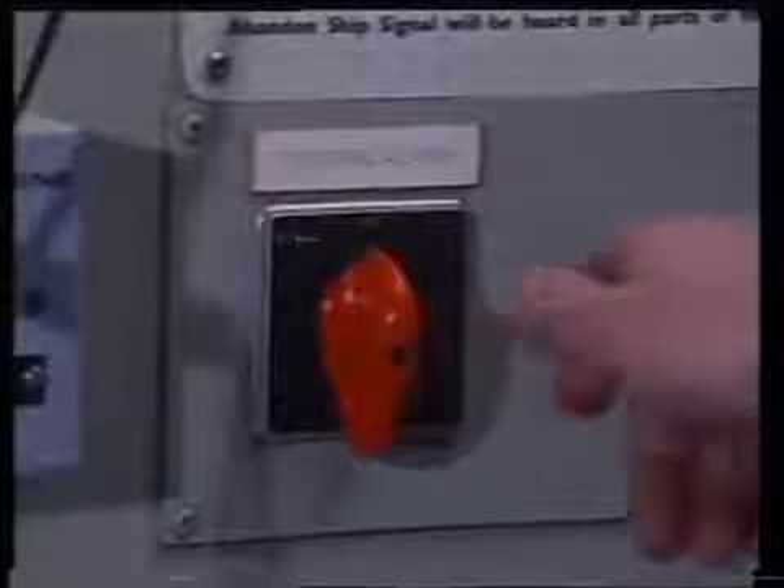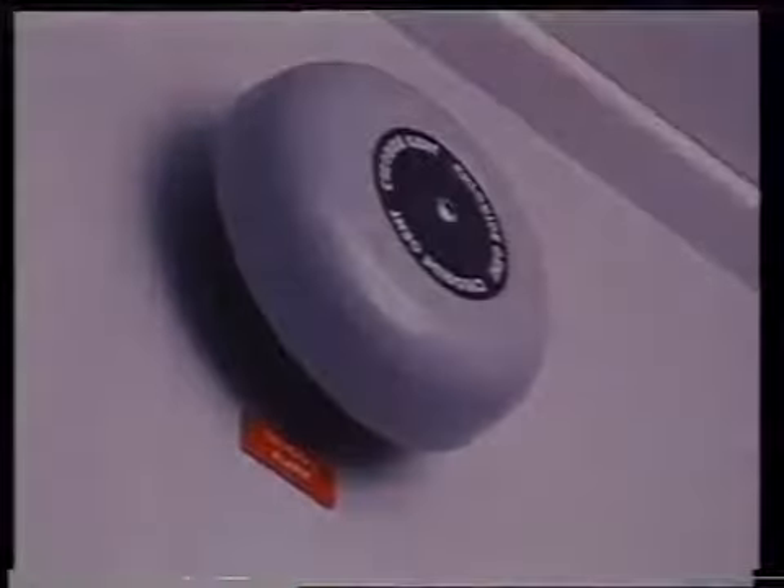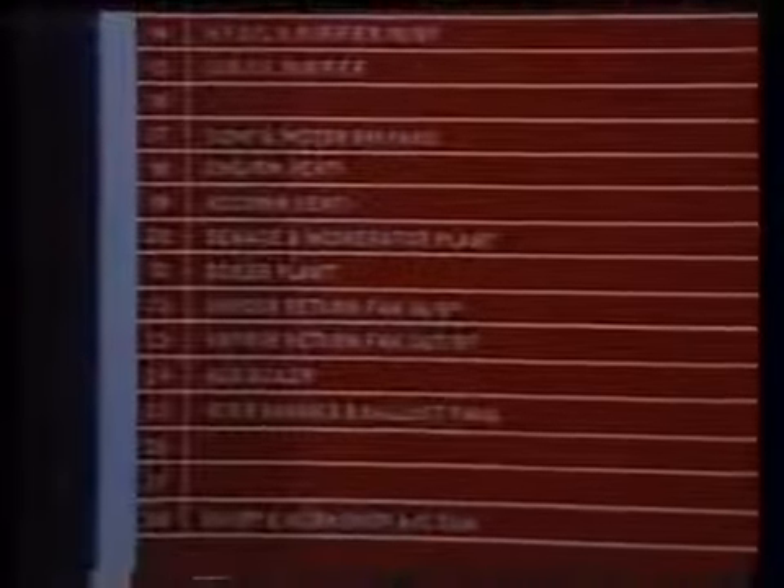The fire and general alarm system must be checked periodically, ensuring that the various sensors for detecting smoke or fire are functioning correctly. If a unit becomes faulty, replace it according to instructions supplied by the manufacturer. A number of emergency stop buttons for certain engine room services are housed outside the engine room entrance, either near the chief engineer's office or the emergency control centre. These are simply a set of duplicate remote stop switches and must be tested periodically for correct function.